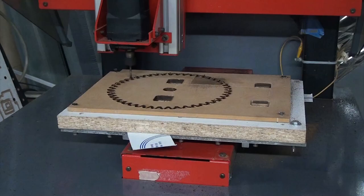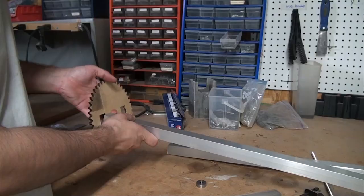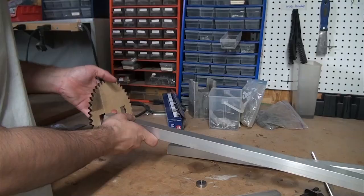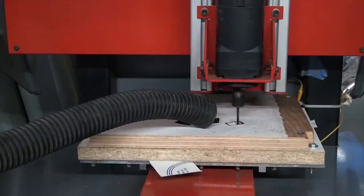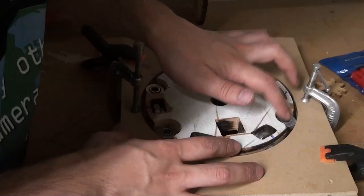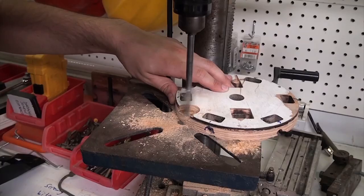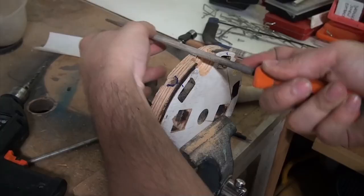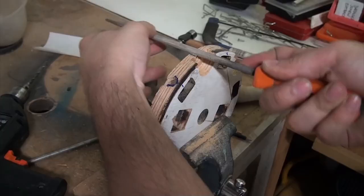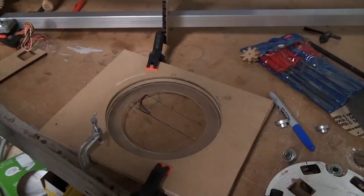I moved on to the lower assembly. The gear had two square holes milled into it, which had to be filed to their final dimension. This way, the two vertical supports can fit through, and I won't need to add a key like I did last time to deal with slippage. The main design consideration for this whole build was to have as little slippage as physically possible, since that was the most frustrating part to fix last time. The next piece I milled out is what the whole assembly will use to let it rotate smoothly. It has six holes for vertical bearings and four for horizontal bearings, though in the end I only actually used three of the vertical bearing holes.